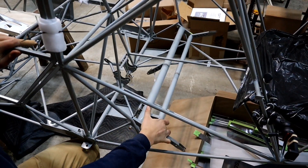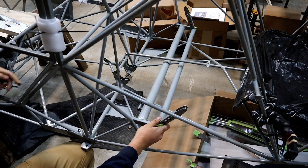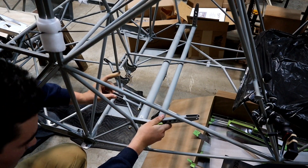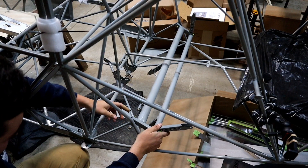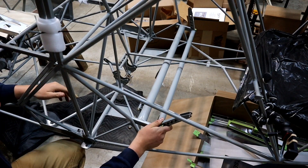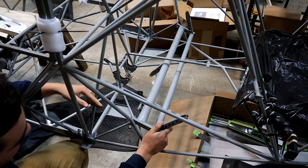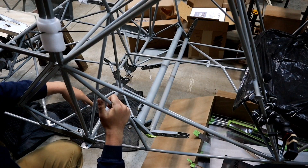This is the flap rod mixer assembly — this is actually where your flaps are controlled. That bell crank connects up in the front with a rod that comes all the way back to this bottom section here and makes the flaps pivot. Can't connect any of these yet — still waiting on those rod ends. But this whole section moves — this big bar moves up and down with this bell crank and the flap lever up in the front. It's called the flaperon mixer. You can see both ailerons move equally up and down, but they can also turn independently — that's your roll function. This is your flap function out of the same control surface. Very clever design.